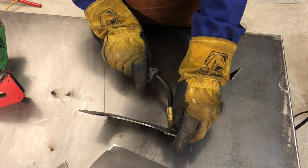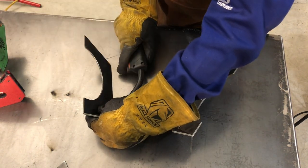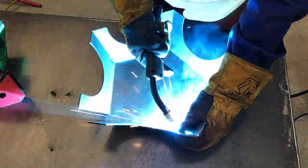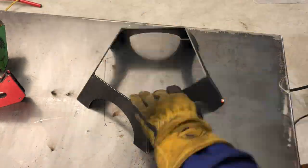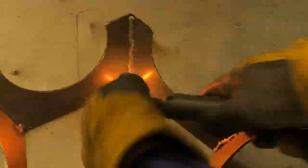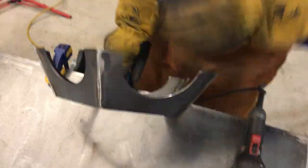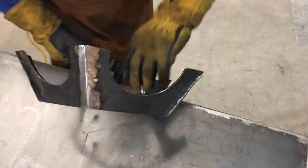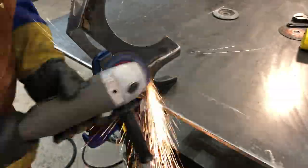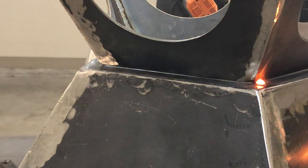You can't see it here but I skipped ahead — as you can see, I made the little pentagon down on the welding table with a sharpie. What you can't see is this is my second attempt. I tried this once already and just tried to throw them together, and that did not work out. Second attempt, I took the sharpie and marked it on the table, and that worked pretty well. All of the feet don't touch down perfectly, but again — fix it with a grinder, right? So I can say fire pit: you can definitely use it for that, and I am almost finished with it as far as a fire pit goes, but I'm going to do something a little different with this one. I've got a different thing in mind, so stay tuned.